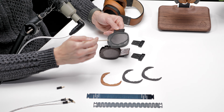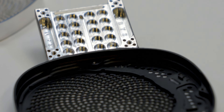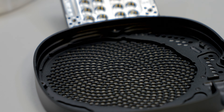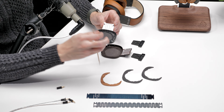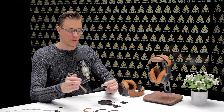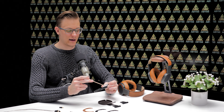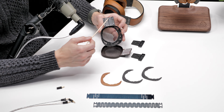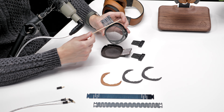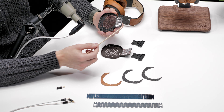One of the nice things about putting this pocket feature in here is we have this rib in here now that provides a lot more structure to the part, so we can get away with thinner features outside. These surfaces are actually much thinner than they would be on a normal part because of the height difference here. It makes this part much stronger, so through our manufacturing process and all the way out to the end user, you get delivered a stronger, better part — and oddly enough, it's still lighter weight. We made a few minor changes to the slider portion of this frame, drilled some holes around these bosses so you could still get good spread of the clamping load for the back plate, but reduces mass where it doesn't provide any structural benefit.